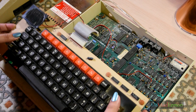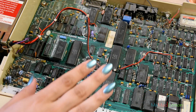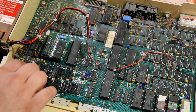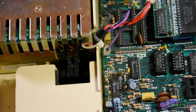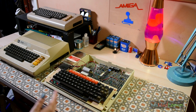Now let's go find the sound chip, because those of you who know me will already know I get excited about the sound aspect of every vintage computer. The sound chip is a Texas Instruments SN-76489 — a DCSG, or Digital Complex Sound Generator. It's a four-channel chip: three square wave tone generators and one noise generator. It's actually comparable to the AY chip, which you'll find in systems like the MSX, the Amstrad CPC, the Vectrex, and the Sega Master System.